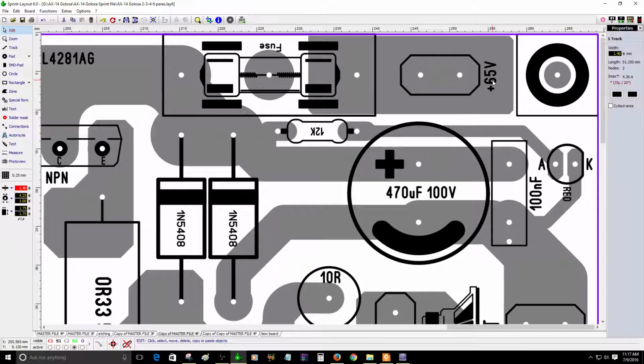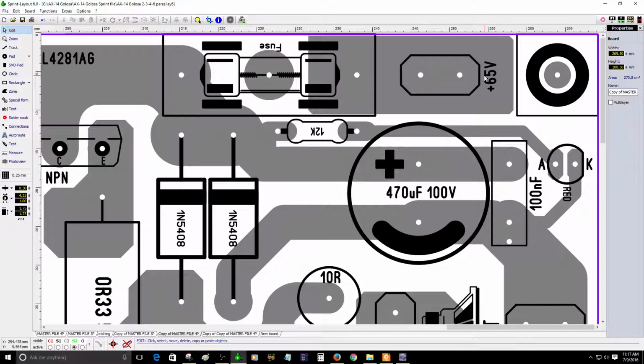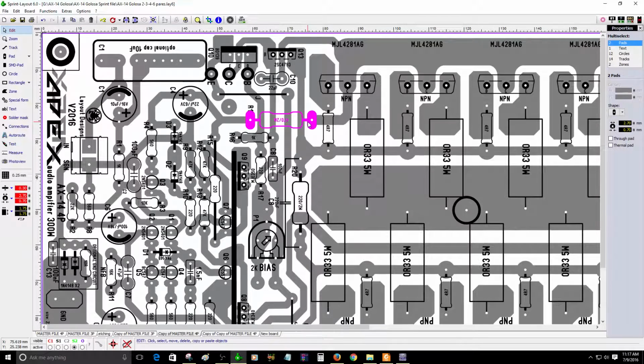All right, we have here the fuses. I have to change this value because actually you have 6 pairs. You can feed this amplifier with a maximum voltage of 85 volts DC, so from 50 volts up to 85 volts DC. That's why you need to change this resistor. These are the ones that will feed the circuit. One sample I'm going to show you.